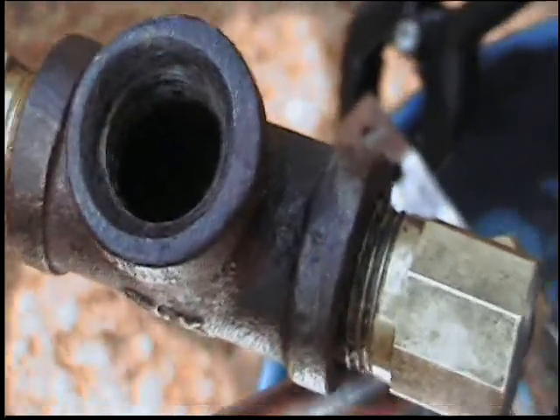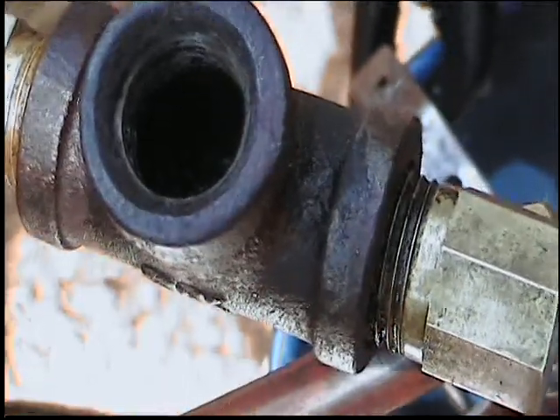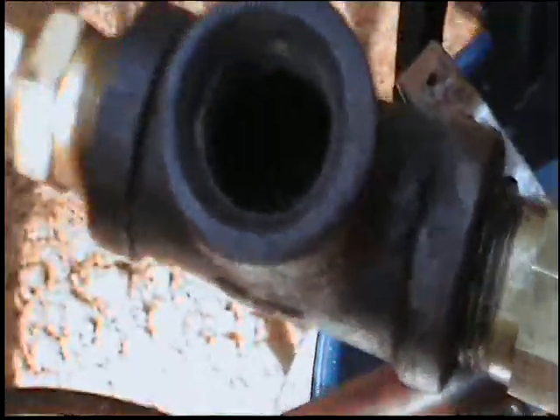The oil goes up through this brass fitting to a tee here, which is open at the top. That way some of this steam can escape without condensing in the oil, or air bubbles can just pop there. Then downhill there's a piece of three-eighths inch copper tubing where the oil will drip down — it bends down and drips onto the ball.